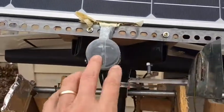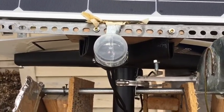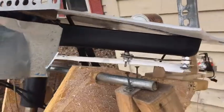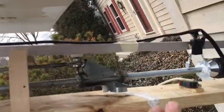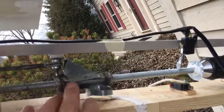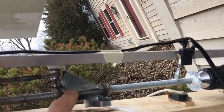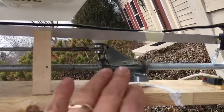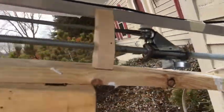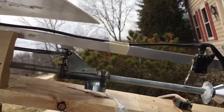This is the sensor that causes the solar panel to move - which it just did - and I'll get more on that later. I'm just going to focus on the mechanics for now. This is an arm built here with a push rod and a little bearing. This arm is driven by this shuttle - this moving object - it's just two nuts on a threaded shaft, hooked up by this crudely soldered piece that I fabricated. As the motor turns, the shuttle moves along the shaft and pushes this rod.